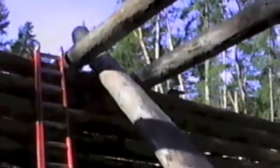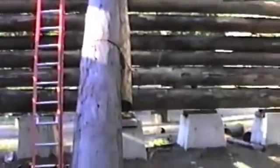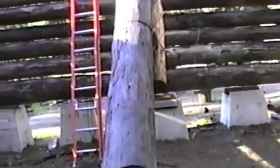All right. This is the center ridgepole that you're looking at. We're getting ready to pull it up to set it on this pier. This is going to be a fairly tricky job. There's nothing to attach it to. I want to pull it up using this pulley here, with a truck right out to the bottom there. I'm going to have some cables to tie it off, so that I can tie it at the 4 corners there and there and there and there, until I can get it stabilized and also get it attached to the floor joist with some other small logs like the one that's attached to it right now. It'll have to be temporarily attached until I get the ridgepole up.